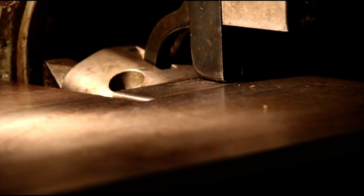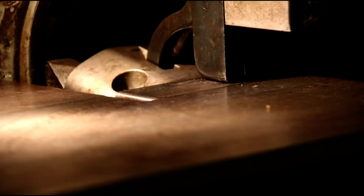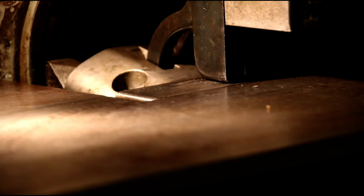Okay, everybody, like I say, you could bend these flanges on your finger brake, press brake, whatever you have, but I'm going to run them through the flanger. That way I don't have to worry about setting up any fingers on anything, and it's a little bit bigger than the press brake I have, so we'll just use the flanger like a box and pan brake, and we'll get real nice flanges. We'll have the exact same radius on all of them instead of switching from one brake to another. It's just the way I'm going to do it here.